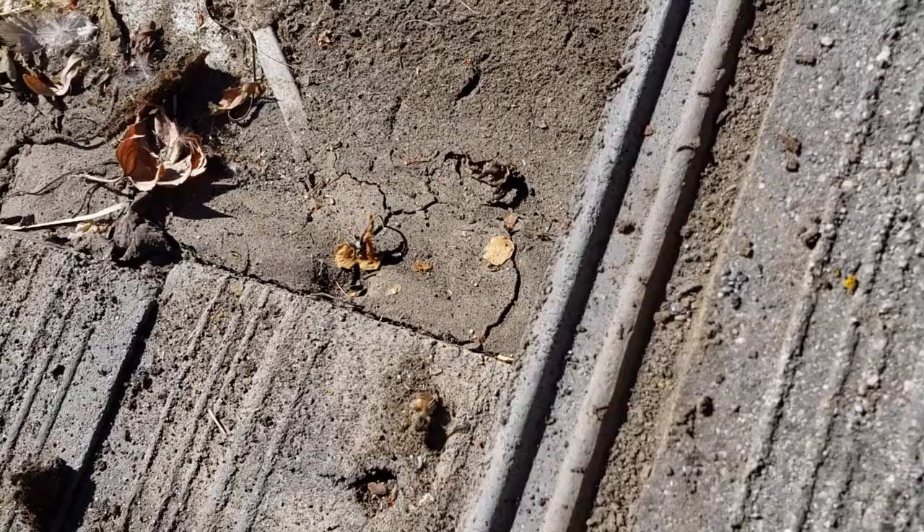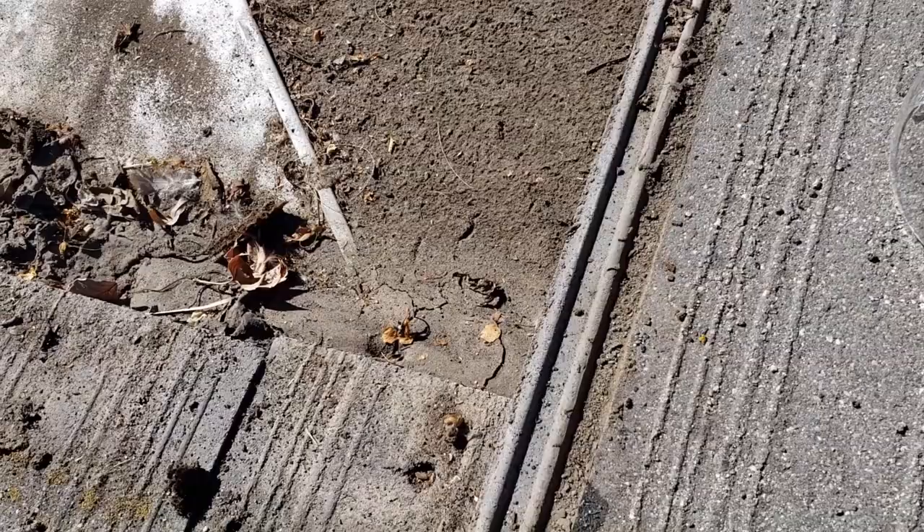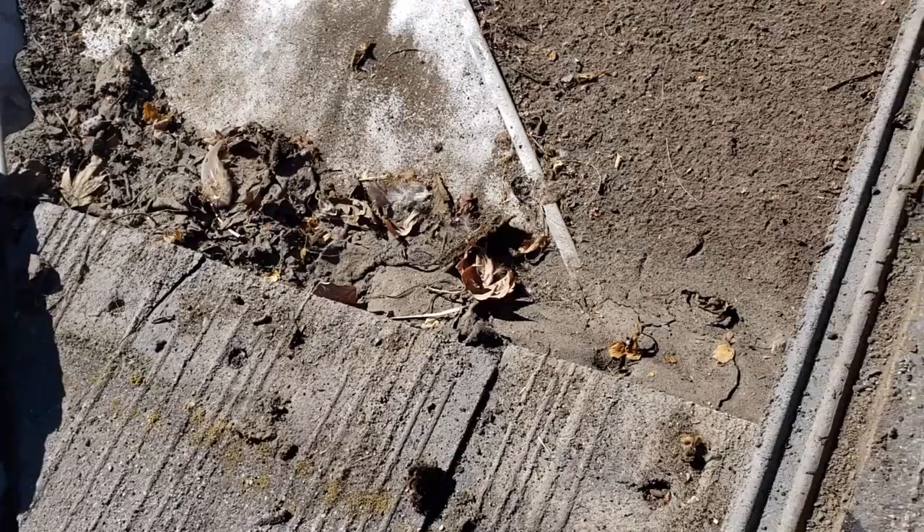A tile roof, generally speaking, does get some water on it. That's why they space the battens out — to allow the water to work down — and have heavy-duty felt paper down there. But this is where you start to get into trouble: the water is getting dammed up and sitting.